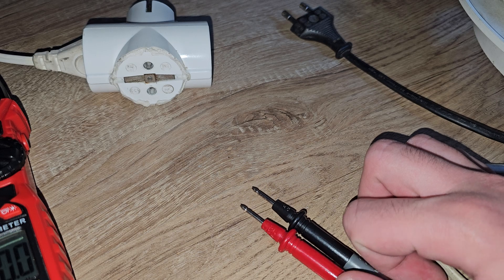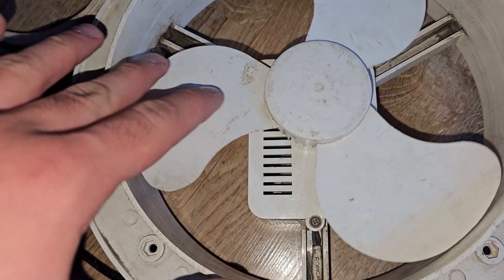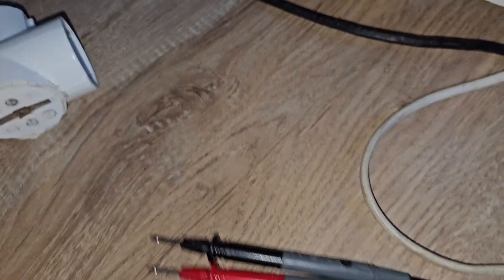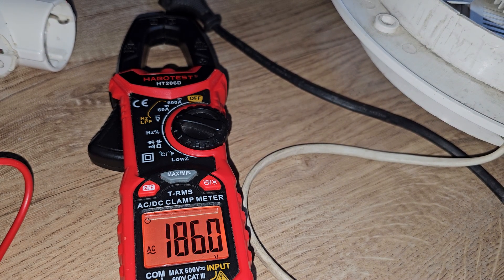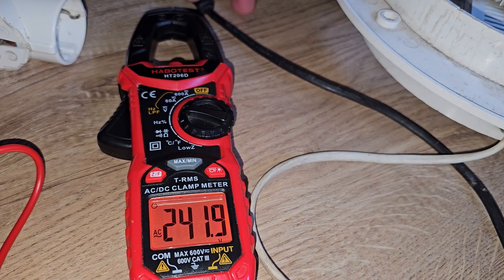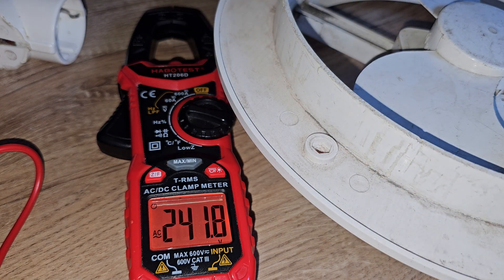I will use 60 hertz. This one fan is designed for 50Hz and this one for 50-60Hz, so for this one there should be no problems, but the other will work but probably will make a loud noise. These fans are really really old and I'm not sure where I got them, but they still work. Here I have my multimeter set to AC — I should go up to 230 volts something like this.